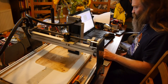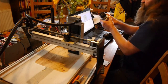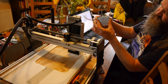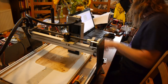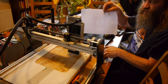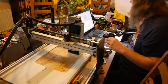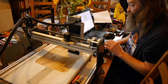I need to find a way of mounting a bigger spindle on here because the original Dremel mount that came with the thing just isn't going to work. This plate, which originally held the Dremel to the front, isn't quite wide enough for these motor mounts. I think I should be able to just make a wider plate. I found a piece of six millimetre aluminium stock kicking around so I can use that. I've made a template at a sort of one-to-one scale of the adapter plate I need to make. I'm just going to stick this template onto the sheet of aluminium and use it as my drilling guide. Then we can mount the spindle onto here, get some wiring done, make sure that works, and then we might be in a position to think about actually doing some carving.